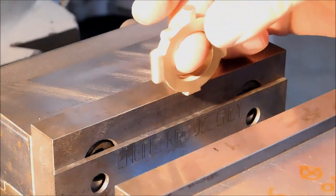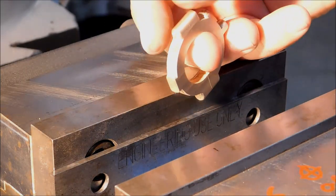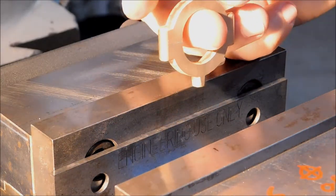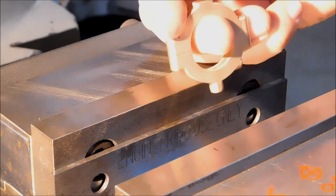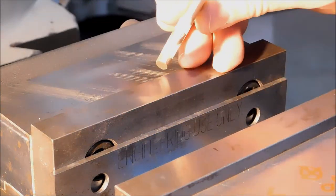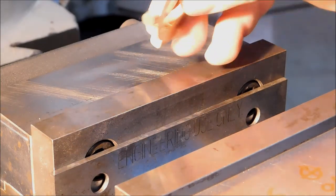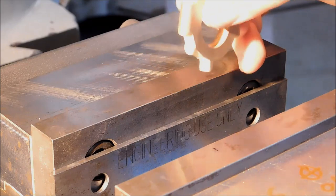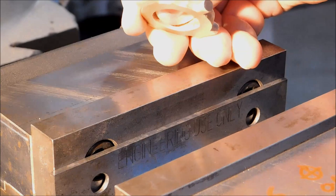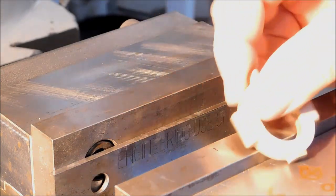This will be a multi-op part because I have to do the link rod here, the oiler, and then from the opposite end, you do the clearance holes and the threads coming in from this side. And that is probably just because the oil cup is there and the head would be too tall for it if you came in from the front. So please don't make that mistake. Clearance holes on the opposite side of the oil cup, threads on the side facing the oil cup. Okay, I'm going to do this hole first.